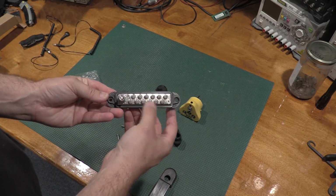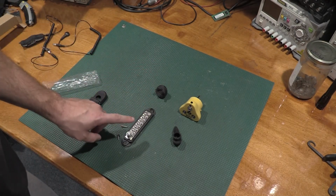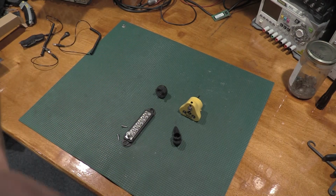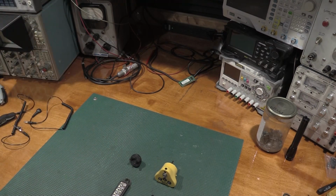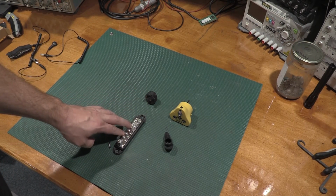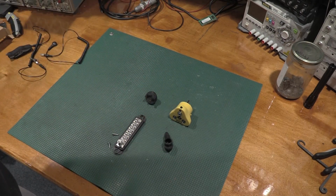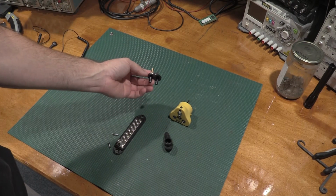So on the other box, we have a nice big bus bar. So what I'm going to do is I'm going to wire the ground point to this bus bar. This bus bar is then going to distribute ground around the bench, not to be confused with some of my, pardon the camera movement, some of my ungrounded power strips for safety reasons. We're going to have a ground distribution point where I can get everything into the bonded mains and get those safely back to earth. So let's hook up an ohm meter to this and see if this does what I think it's going to do.